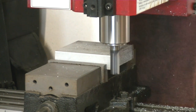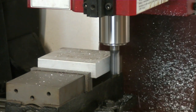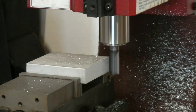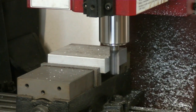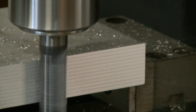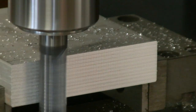We've got a 3x3x3 quarter inch 6061 aluminum. I'm using a Lakeshore Carbide half inch roughing end mill, just trying to get a feel for how it's going to cut. I think it does a great job even on this little mill. If you look closely, we're doing some conventional and climb milling and it works out very, very well. The roughing end mill works great.